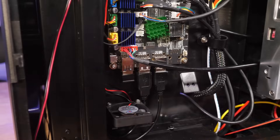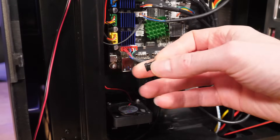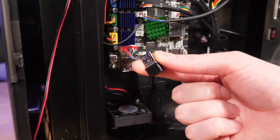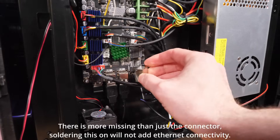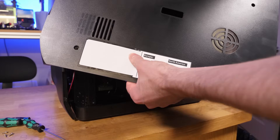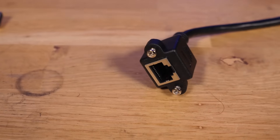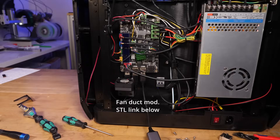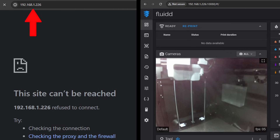There's also no Wi-Fi setup in the initial wizard, and it turns out the board doesn't actually have Wi-Fi built in — it's just a plug-in USB adapter. The specs they sent me say it has Ethernet, so maybe we'll just use that. Except it doesn't — the hardware components have not been fitted to the control board. However, if you look under the label on the back panel, you'll find a square hole with mounting holes either side, exactly where the Ethernet port should go. So I purchased an Ethernet panel mount and USB-to-Ethernet adapter, plugged it in, and it works — though not in every USB port, and you have to unplug the Wi-Fi. Lastly, you can't go directly to the printer's IP address like with every other Klipper machine — you have to add port 10088. Why? I really don't know.